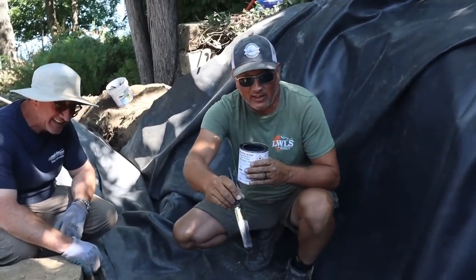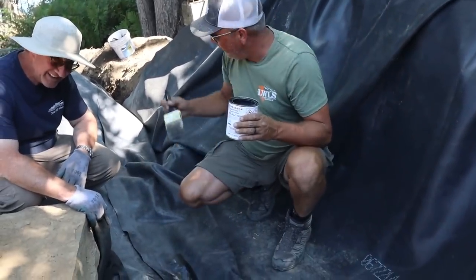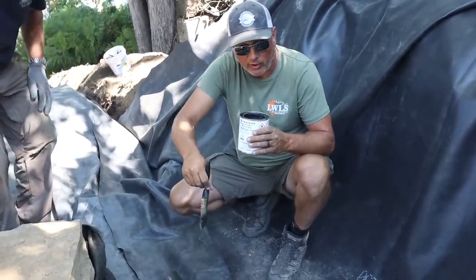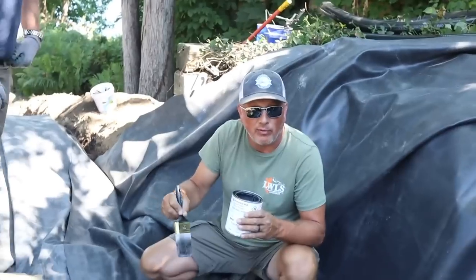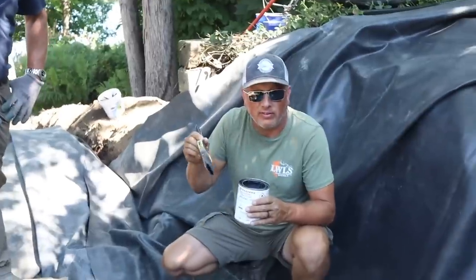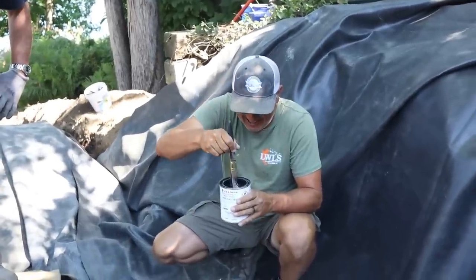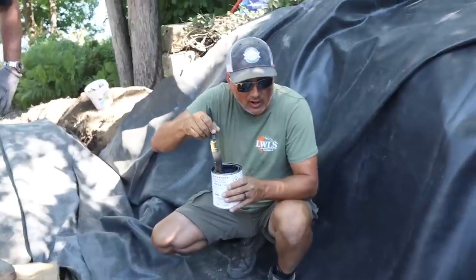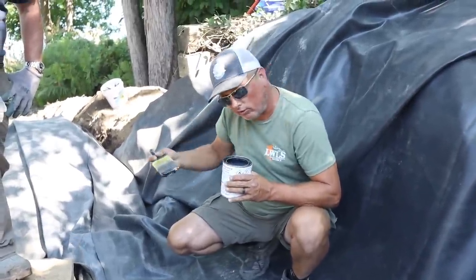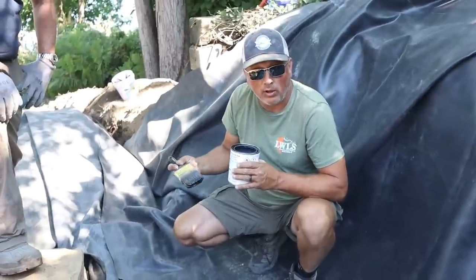Well, we're struggling, you know, you got to get this board if you don't have a board that goes all the way, which is rare. So I'm going to drill a hole in a board and put a string on it. Board stretcher in your truck? No board stretchers. We had one and then somebody lost it. I left mine home. So your idea is what? I interrupted you. So we're gonna drill a hole in a board and put a string at either end or a little rope so that we can just pull the board smoothly through the liner underneath.